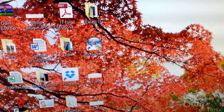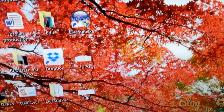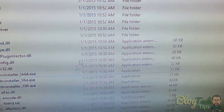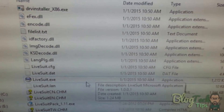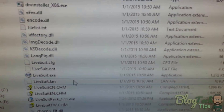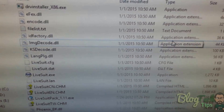Next, you're going to download the LiveSuit program — you can see it on my desktop over here. What you do is download it, then extract it, and then launch it after it's extracted. You go inside the folder, extract all the files, find the launcher, and launch the LiveSuit program. After it starts up for the first time there should be a driver warning — go ahead and select the second option.